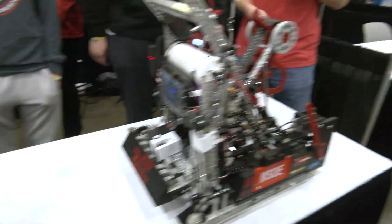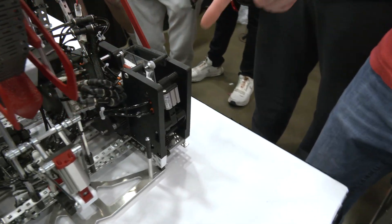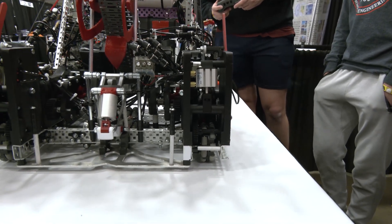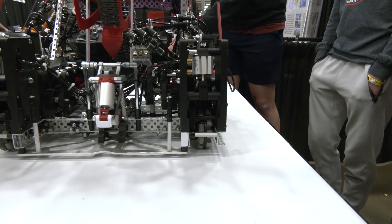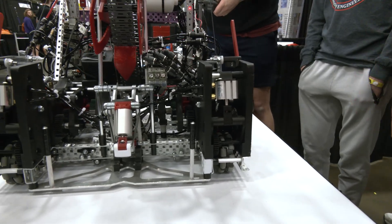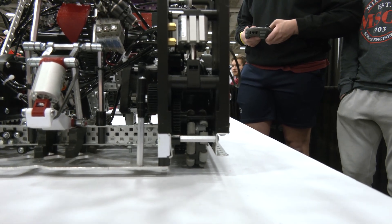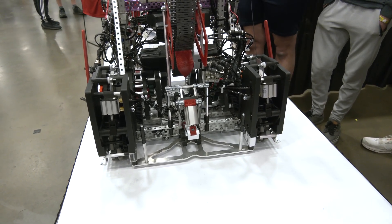This PTO went through several months of work — I believe this is revision four or five. We were initially trying to use something that wasn't multiple motors and would be easier to integrate, but we just could not get the power, so a PTO was absolutely necessary. On our first drivetrain we didn't have a lot of space for traditional sliding gears, so I made it so the gear rotates around the axle of the winch and one piston pushes it in. When it disengages, the string could possibly come loose, so we also included a brake in this PTO so that during the match and at the very end we engage the brake and it will not move at all. I've tested this to twice the weight of the robot on a single PTO and it's still holding. Another improvement throughout development was making it easy to change out — in one version I had to do a lot of screws and it was very tedious to take out, but now it's four screws and I can change it out in less than 10 minutes.